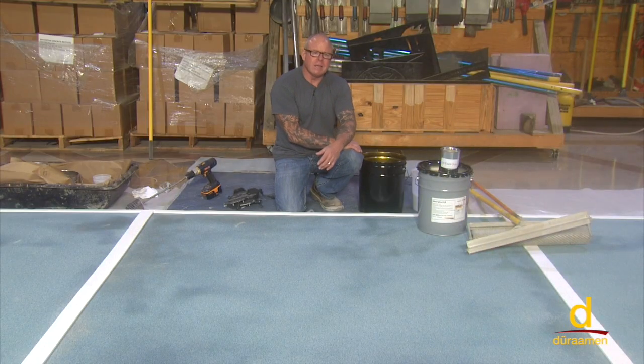On this panel, we're going to demonstrate the MMA self-leveling mortar body coat. Add self-leveling filler to the Macrolux B18 and mix thoroughly for one minute using a slow speed drill and Jiffy mixer. Add MMA pigment at 1 quart per 5 gallons of MMA resin and continue mixing. Add the Macrolux Hardener to the B18 MMA resin following the mix ratio chart in the technical data sheets. Continue mixing for approximately 1 to 2 minutes. Typical slurry mix ratio is 15 to 20 pounds of self-leveling filler, equivalent to about 1 to 1.5 gallons per gallon of MMA resin, depending on the temperature and desired thickness. Pour the mixed resin slurry in ribbons and spread evenly with a gauge rake or trowel at the specified thickness, generally about an eighth of an inch thick or thicker as required. Immediately back roll with a loop roller or spiny roller.